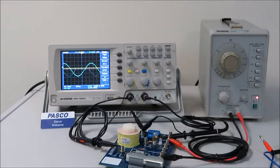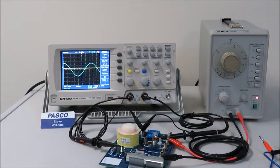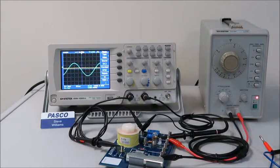So as you can see now, we have the oscilloscope's standard leads being used, and we have a signal on the second channel, which is across the capacitor, but in this particular case the coil is now shorted, and that's obviously not going to work for us, so we cannot see any signal from the coil. So we have to remove those and put in the Electrotest ETL ISO transformers in place of those leads, and let's see what happens.